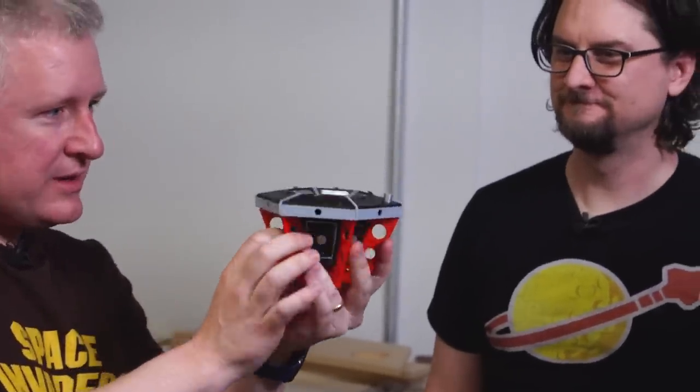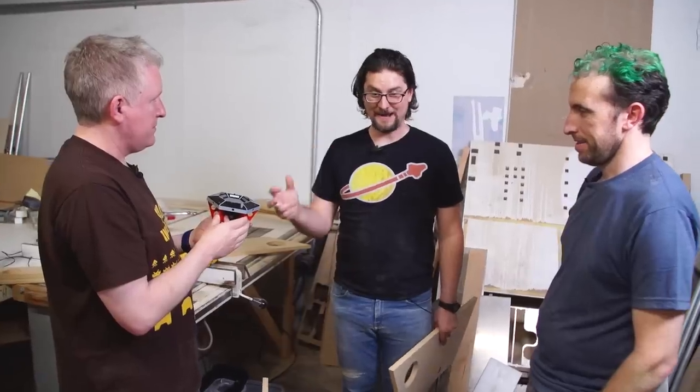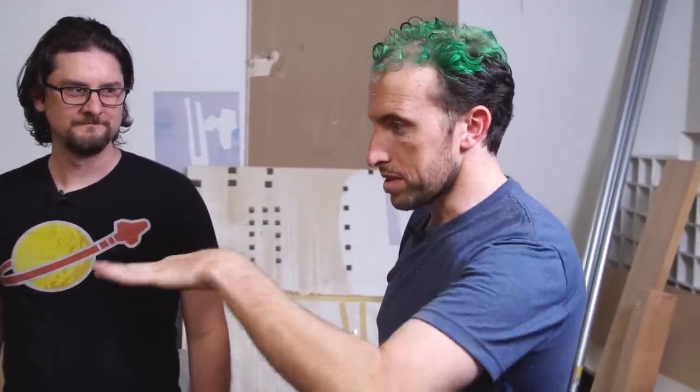Guys, I was looking at the 3D print — the cup holder is at an angle. Is that going to be a problem? Eh, it's partly the 3D print. This actually illustrates the challenges of doing this table. Because of the hexagon and angled panels, each one of these cuts is a compound angle. The challenge is the machine cuts straight down only — you could maybe tilt the head, but then only one side would be at an angle. So we're trying to achieve these compound angles with straight cuts, cheating it. One approach is a second operation: cut the outline first, then come in and cut the angles on pieces that need to be angled as a separate process.